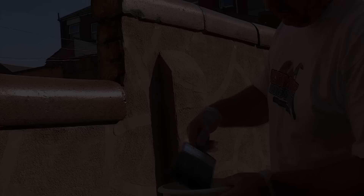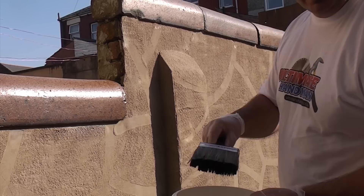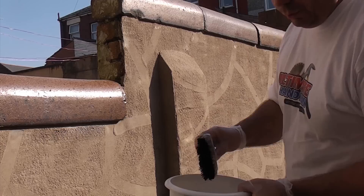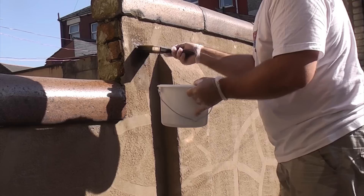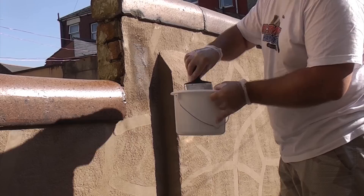Now I can actually start to stabilize this wall, and when it's dry tomorrow we'll be able to paint straight onto it. Using a larger four-inch brush will make it a lot easier and you'll get the area covered a lot quicker. One thing you can't do with stabilizing solution is spray it on — you've either got to paint it on with a brush or a roller. You can see immediately that it is soaking straight in because the surface is very absorbent.